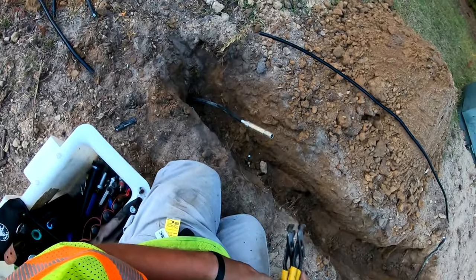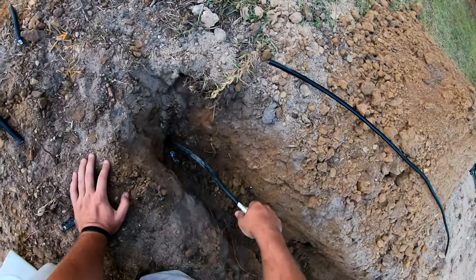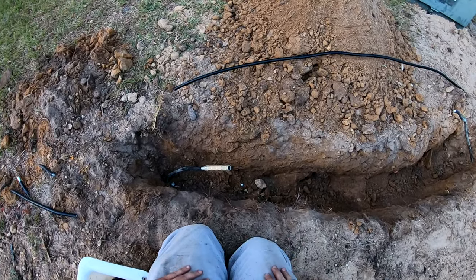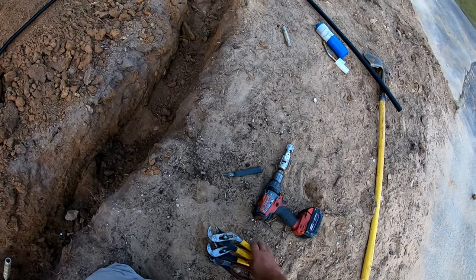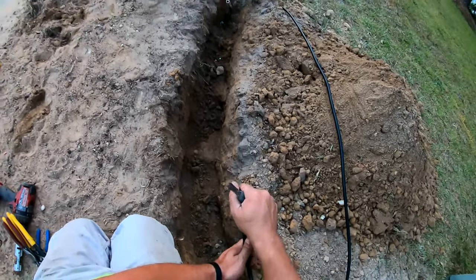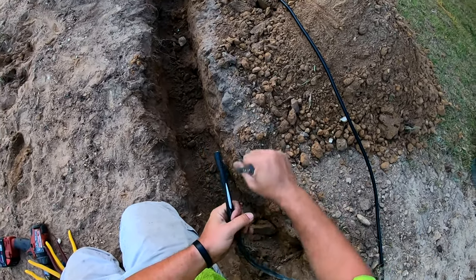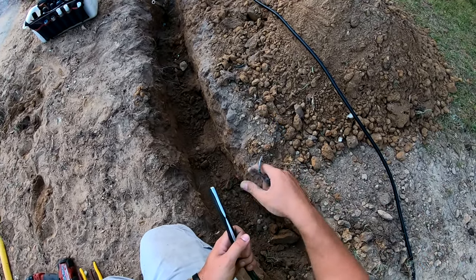Okay. And it's the same thing all around, which I will do, but probably won't necessarily explain from here on out. But that's how you core and splice. So I'm just gonna go ahead and get this other side prepped. Always a good idea, when you've got the tail back jacket, to have the cable and the knife facing away from you. Obvious reasons.